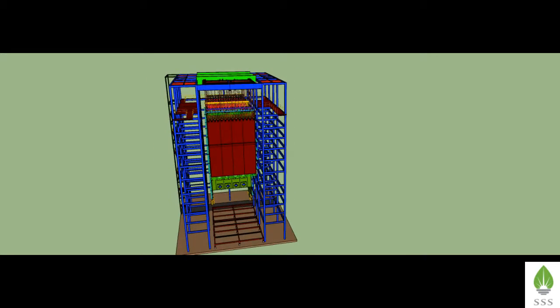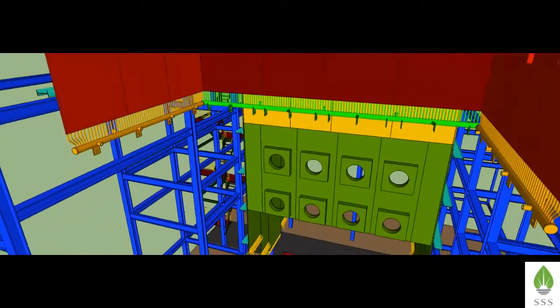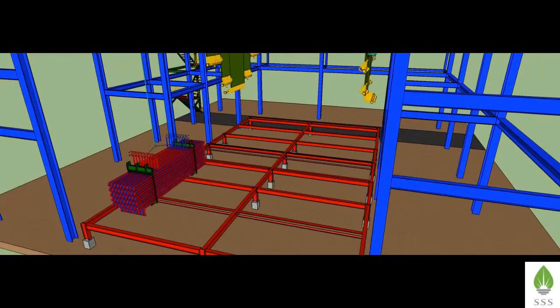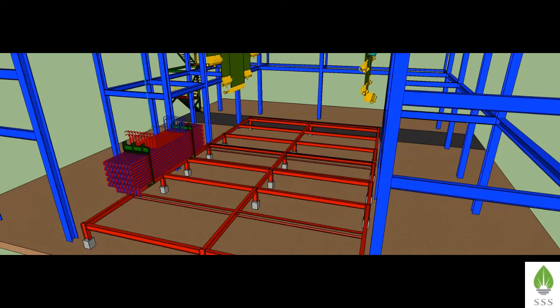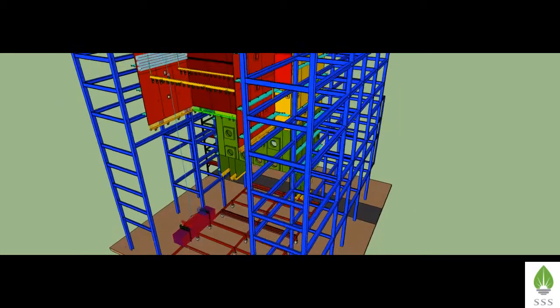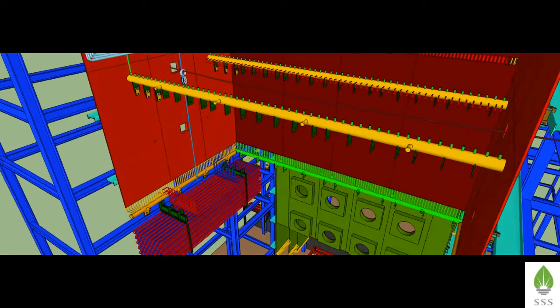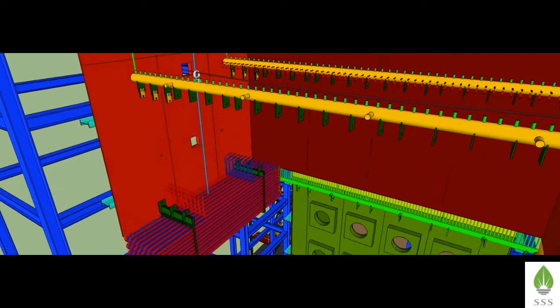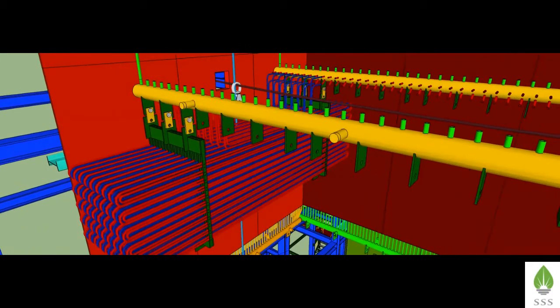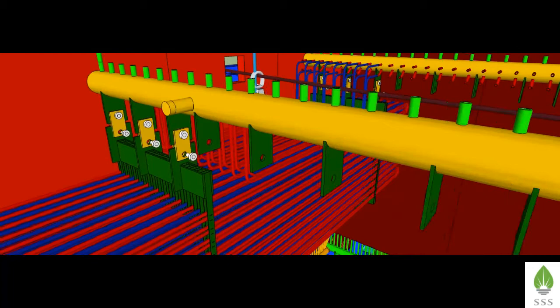The cage rear panel is hidden to show the animation clearly. Similar to the primary superheater coils, the same lifting arrangement is followed. A floating pulley is suspended on a wire rope tied between two supports welded outside the side wall panel. Lift the economizer upper coil set with the lug plates and erect it to its position. Insert the bolt through the lug plate and secure it with a nut. Now we can weld the economizer coil tubes with the stubs of the headers.